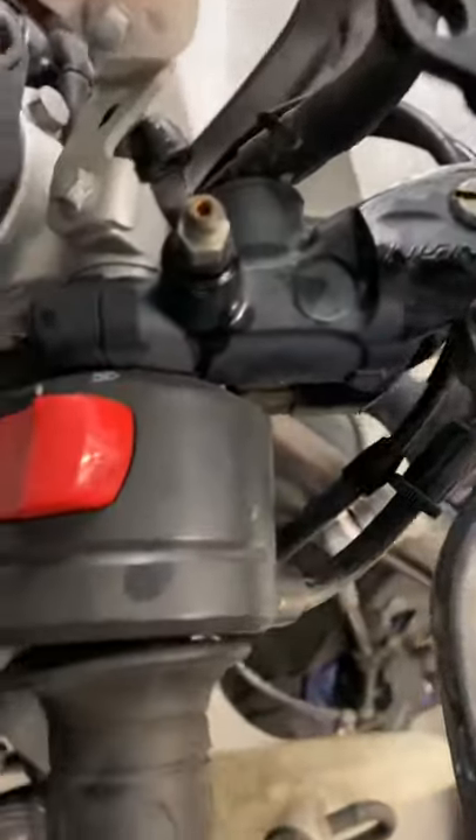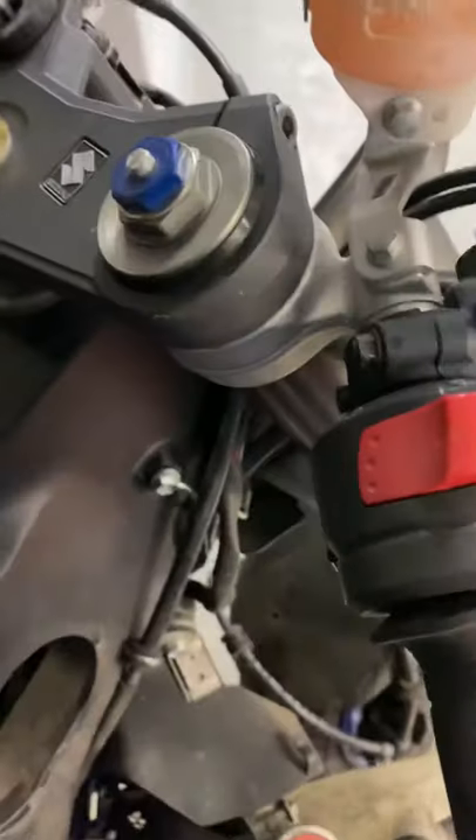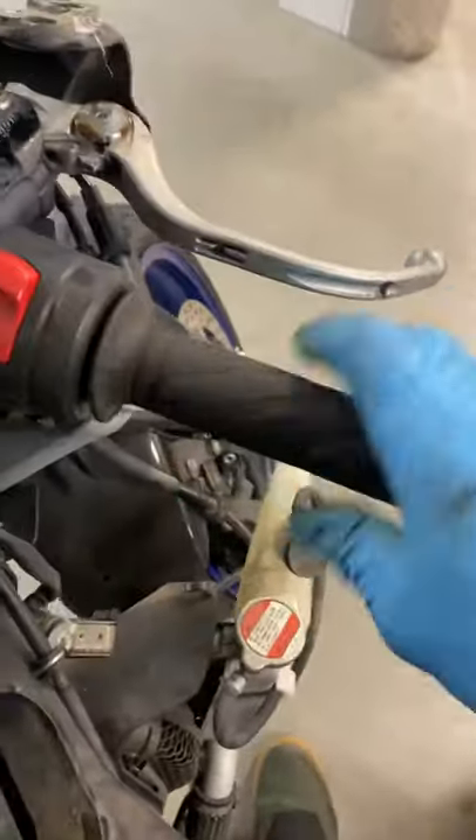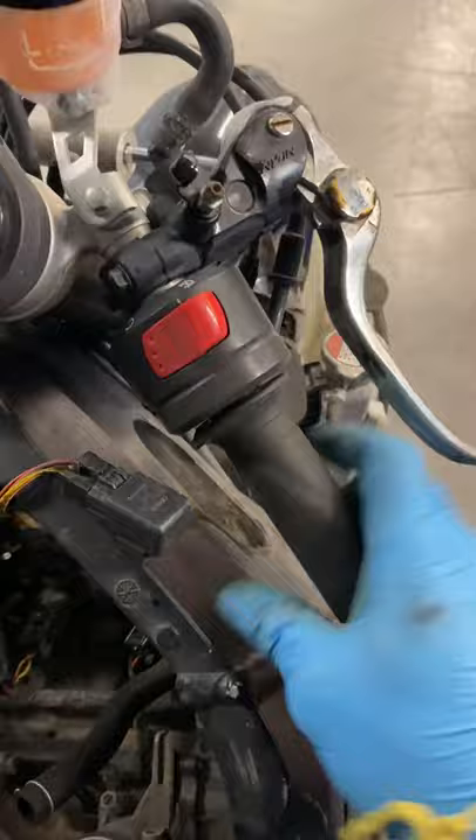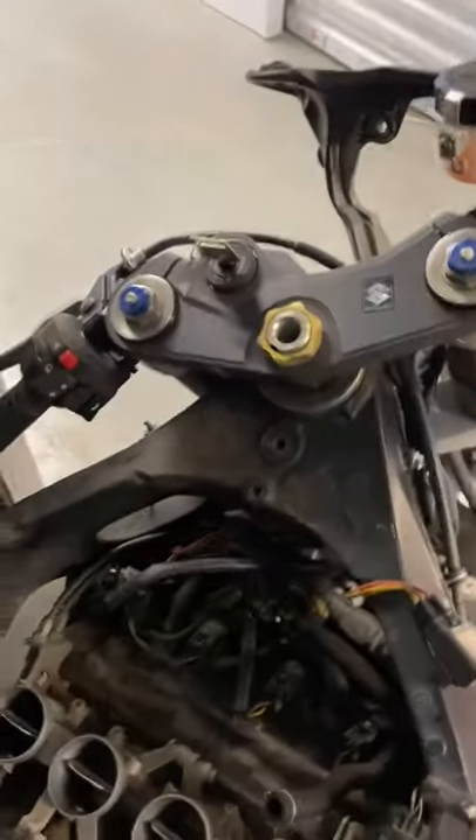You can adjust if you're in a pinch, but just replace the cable — simple. I'm gonna put this back and show you the adjustment from here. With the adjuster in the right position you get a nice throttle. You gotta move the handlebar around and make sure in every position it comes back nice and tight.